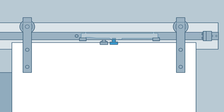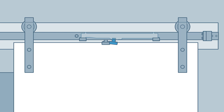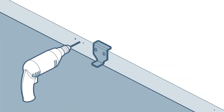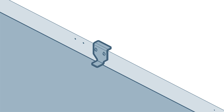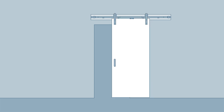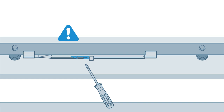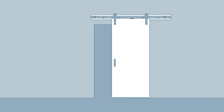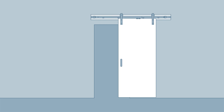If you find that your second actuator is too close to the first actuator, shift the soft close assembly over until the second actuator can sit flush on the door. Mark the actuator's screw holes. Remove the door from the track, drill the marked holes, and install the second actuator. Reinstall the door in the center of the track. Use a flathead screwdriver to open the catch of the soft close assembly. Slide the door to the open position — it should now open softly and smoothly.